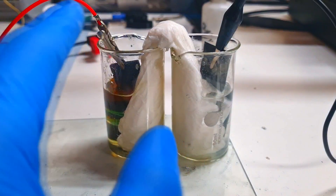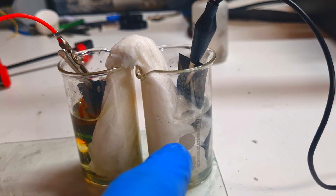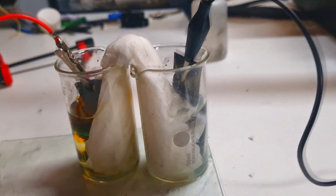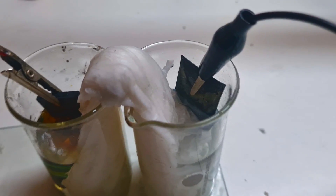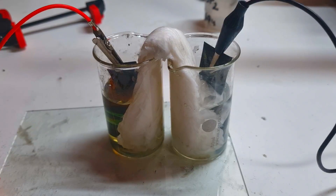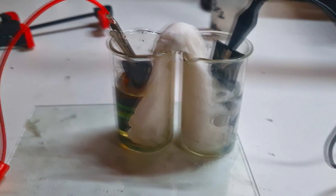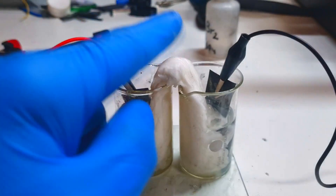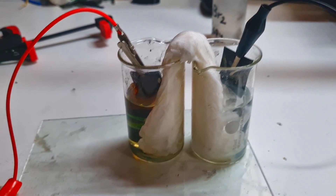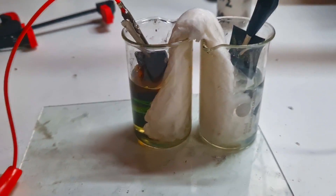You can see that the bromide is held in this container. On the negative side of the cell, zinc is being created — the zinc is electroplated directly onto the zinc electrode. This cell also creates some zinc dendrites, but with this salt bridge cell design the creation of zinc dendrites is not a problem. However, the charging voltage needed is 10 volts. If I increase the conductivity of this salt bridge or increase the contact area of the salt bridge, the charging voltage will be much much lower.